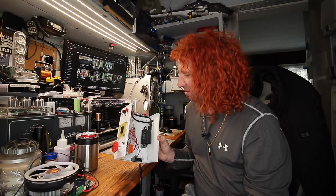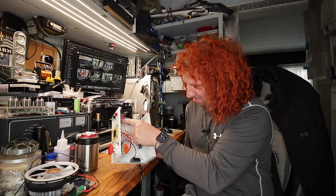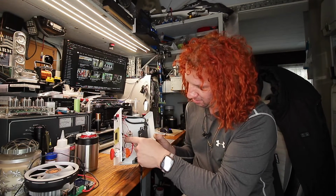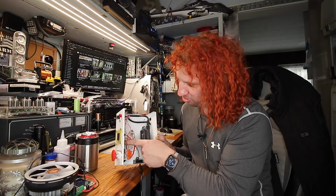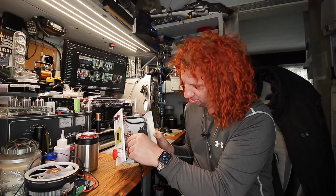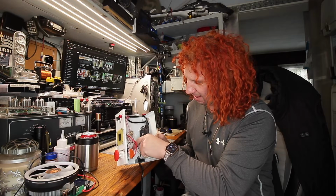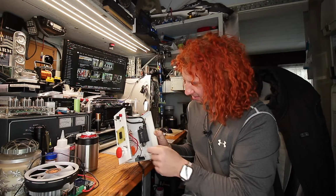So that's pretty cool. So power comes in, comes out through the pilot lamp, comes back out of the pilot lamp, goes into the plug, and then gets jumped to the switch. So depending on which side you got the switch, either it goes to the bulb for testing, so it goes through the bulb, back out of the bulb, and goes into here, which is the little tester.